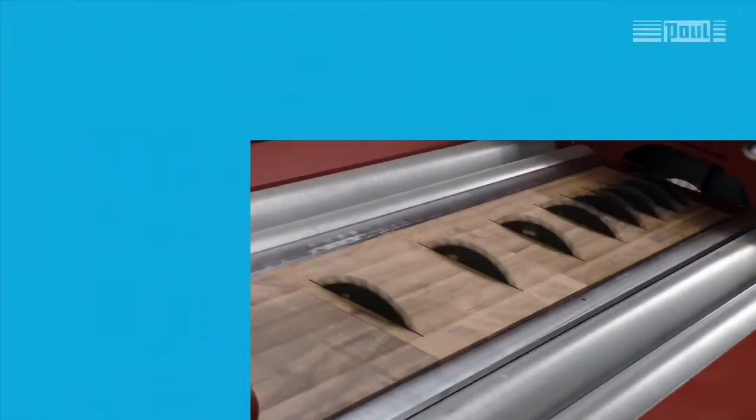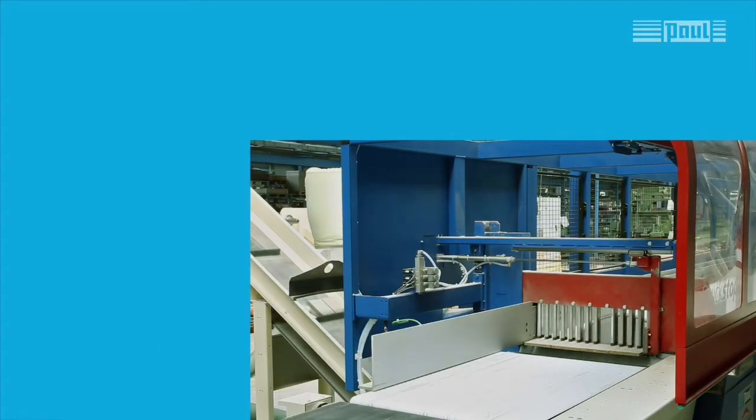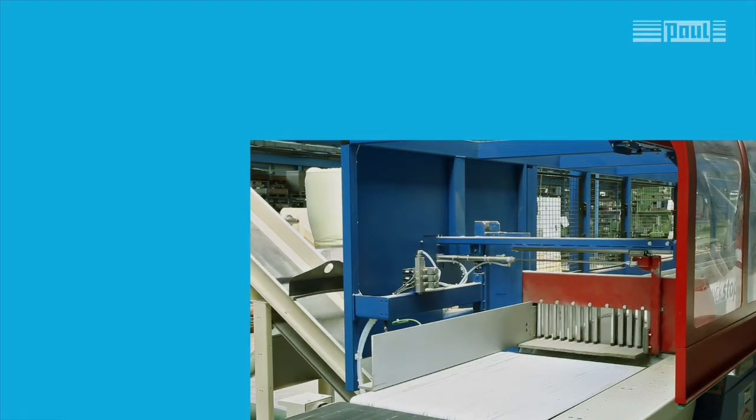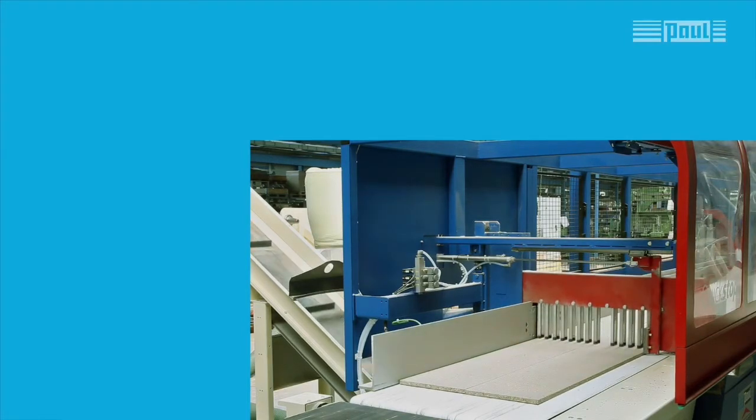Our machines typically use a fixed arbor, but can have moving blades. We can also do cross-cutting with an actual wide crosscut saw that'll cut up to a 4-foot panel after the ripping operation. So you can have an inline rip and crosscut solution for your panel products.